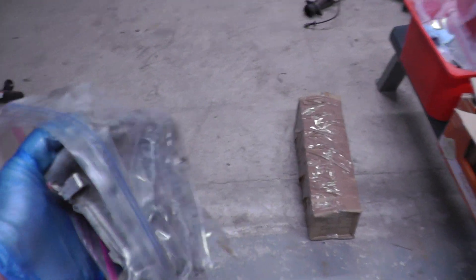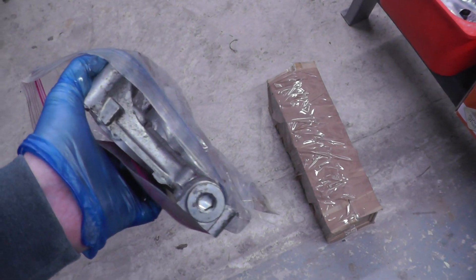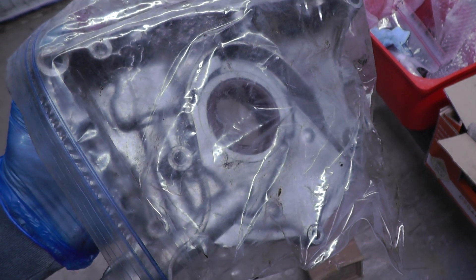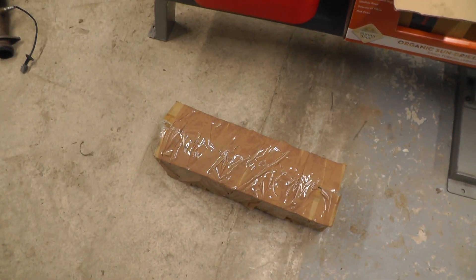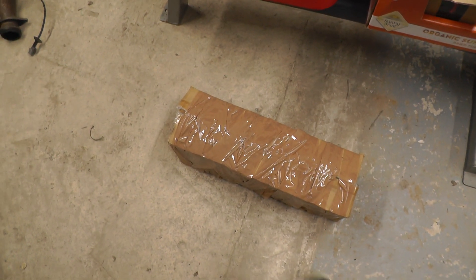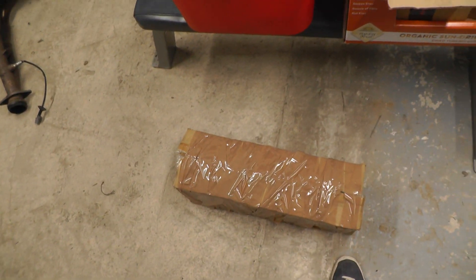The oil pumps — both of them — I've reviewed them now and they're not in great shape. For the sake of a couple hundred pounds, I may as well replace them. They're both worn. Even the one I thought might be okay — the one that came out of the engine originally — actually has got some pickup on it, so that will need replacing too. I won't be using the old pump again. The crank itself doesn't really have any scratches on the actual bearing surfaces, so let's just say that's okay — which is at least one good thing.